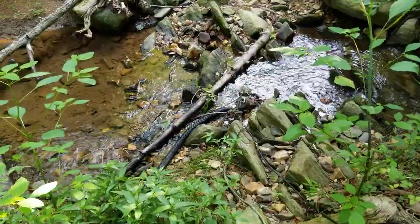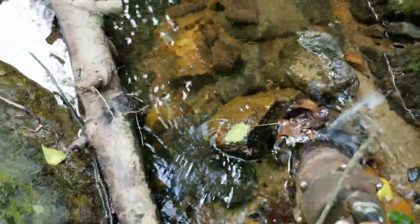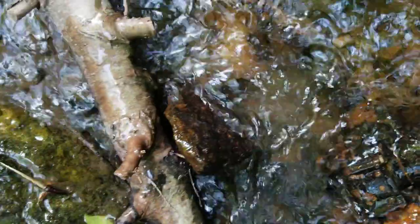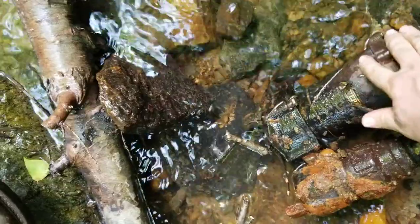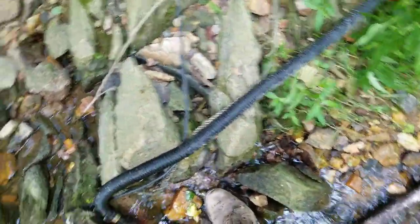And while we're here — I wasn't planning on doing this — but a little tip. I really like to have the pump oriented the other way. The stream is going this way and the mouth of the pump is down there. I like turning it around so that the mouth of the pump is pointed downstream. That way, when you get all the debris that comes washing down in storms, it doesn't clog up the mouth of the pump. Ideally you want the pump as submerged as possible because the stream will keep the motor cool. Sometimes when it gets really dry, you've got to dig out the stream a little bit and dam it up, make a pool — something so that you have a sump to pump out of.